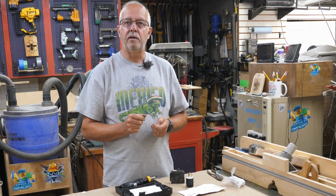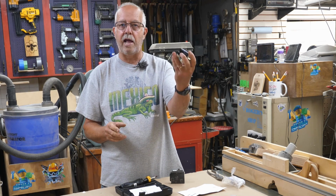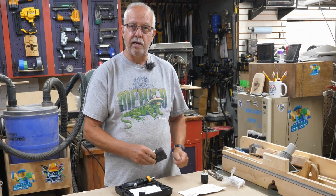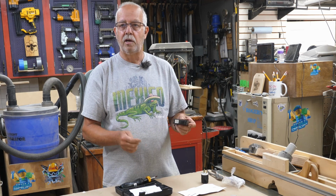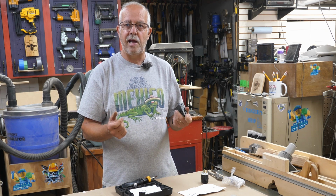However, there's something that a lot of people overlook, and unless you're an electrician in the trade, you probably don't even know about this. Something as mundane as a cord cap, the end for an extension cord, those terminals have a torque specification. And when you get into receptacles and switches and circuit breakers, especially on the larger ones, when you get into the really big stuff, everything has a torque specification from the manufacturer.